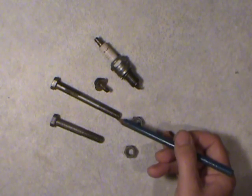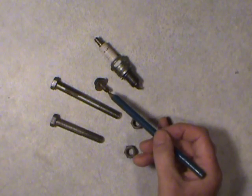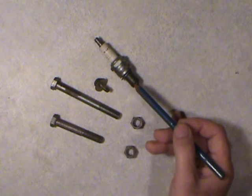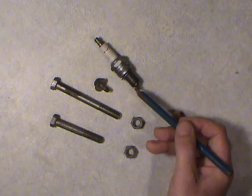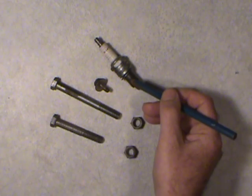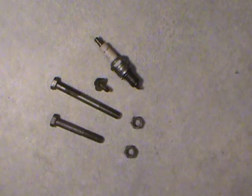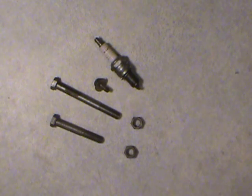This is a general overview for the start of this video and I'll get into a little more detail as we go. This is a 6mm bolt — it's the metric system. And believe it or not, in your Fords, Chevys and Chrysler products you have metric threaded spark plugs. I'll show you how to measure those. That's a 14mm thread, by the way. They're measured by the outside diameter of the thread on all of the different systems. The first two are in inches and these two examples are metric.